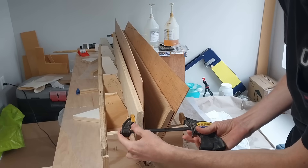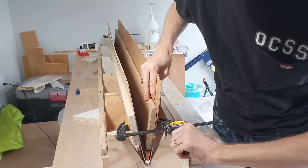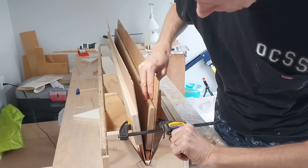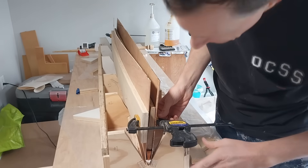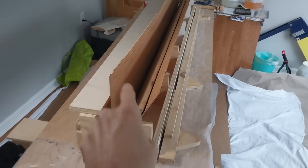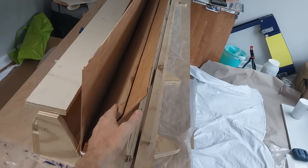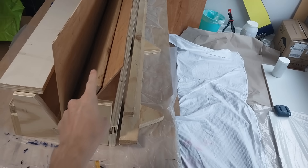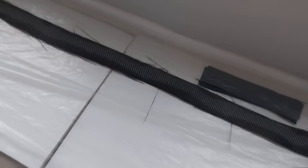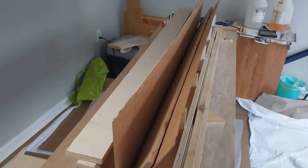It's the next day — this is fully cured. Let's see if I can close it without breaking it. The next steps are to coat the inside in epoxy, then glue the stringer inside, partially close it, and right here in a U-shape I'm going to add four pieces of carbon fiber to create a carbon fiber channel reinforcing the trailing edge. Then I just glue the trailing edge together and clamp it.